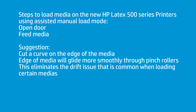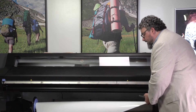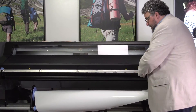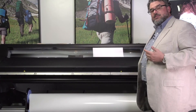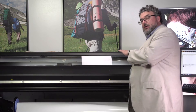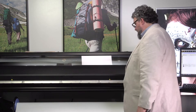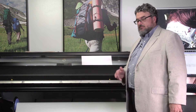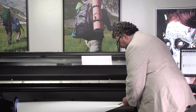The next thing you do is feed the media in. My long-standing preference is, when I take the media, I roll it out a bit and cut a little smile into it — a curve so it looks like a smile. It feeds through the printer easily and tends not to get caught on the pinch rollers. When you've lifted the door and selected assisted manual load, it has lifted the pinch rollers automatically — there's no more lever on the side for a 500 series printer.